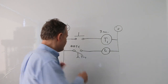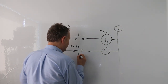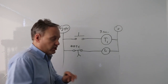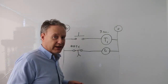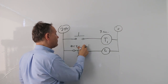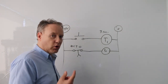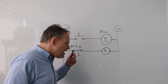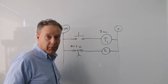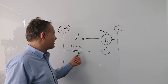If I wanted to reverse the logic, I'd use a normally closed contact. For an on-delay timer, the arrow still goes this way. When you're not touching anything, it's closed because it's in its normal state. This is a normally closed, timed open contact. As soon as I press the button and hold it, nothing happens for three seconds. After three seconds, it goes into its active state and becomes open. When I remove my finger, it de-energizes and returns to its normal closed state.